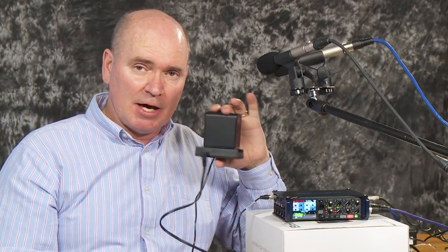Using this high-capacity camera battery via the Hirose connector, the endurance test showed the Zoom recorder ran for about nine hours — in fact it just kept running. After nine hours I stopped it even though the battery still had a little juice left. I was watching the power meter gradually drop below 16 volts, a tenth of a volt at a time, until it reached 14.4 volts after several hours, and then below 14.0 volts. At that point the battery indicator button gave no readout, so I decided nine hours was a good enough test.